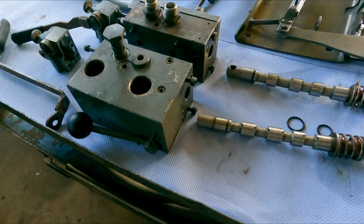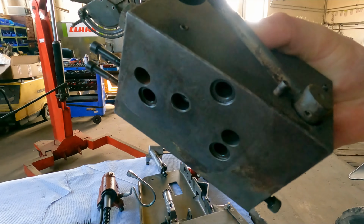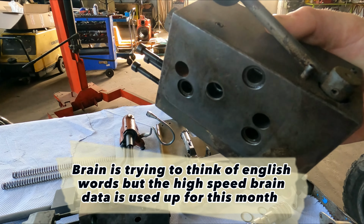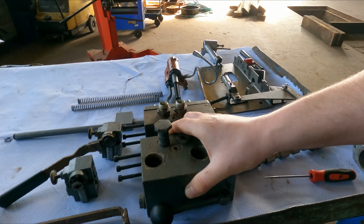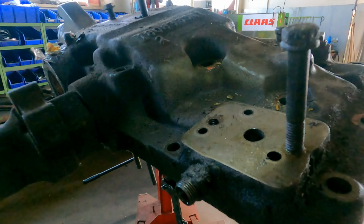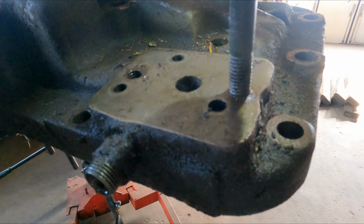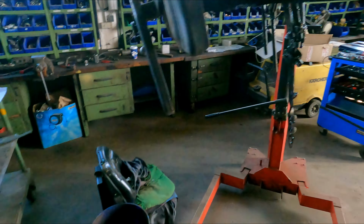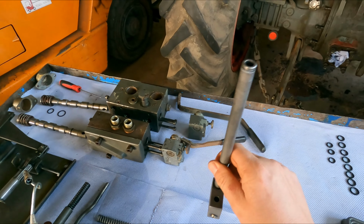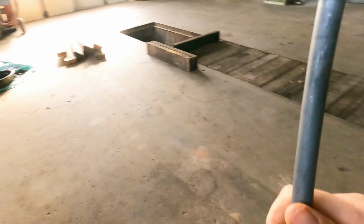And the most common of all is that they leak from the bottom of here. And there's the O-rings that will be sat on, that'll be sat up here on the hydraulic cover. But through this hole here is where the hydraulic feed is, and this is the feed tube that feeds up towards the valve block, and that sits under the hydraulic cover.